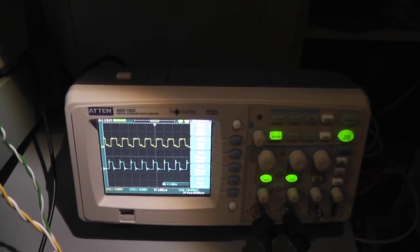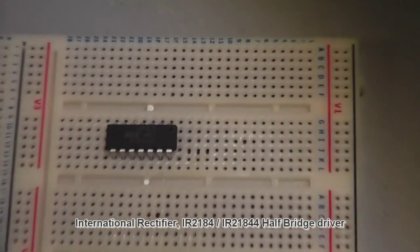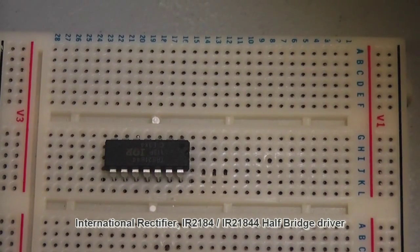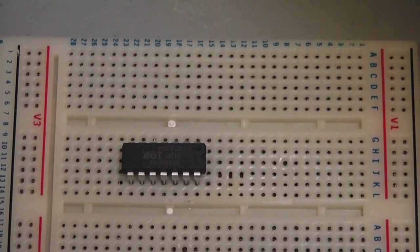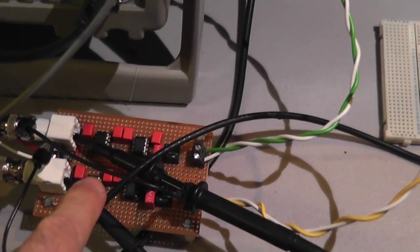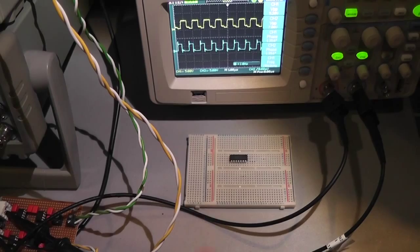That is literally something you would not need to do if you have this chip — this is a so-called IRS21844, a half-bridge driver with a configuration possibility for the dead time. However it is not only this one chip you need — you need a couple more chips because it has a logic input, so you would have to convert your analog signal to digital. It becomes much more complex. However this chip replaces the complete input stage. Of course you still need a signal, but you would not need the two-stage setup, and it has a very small footprint.